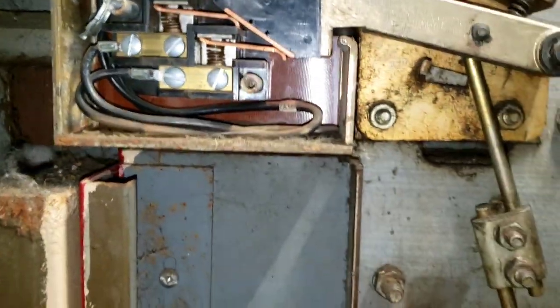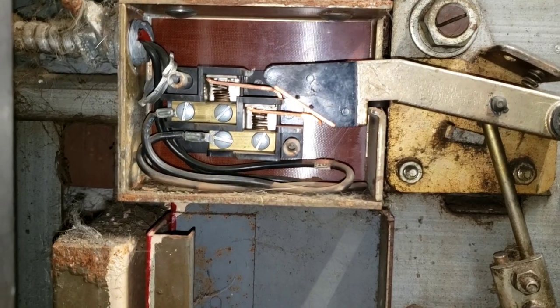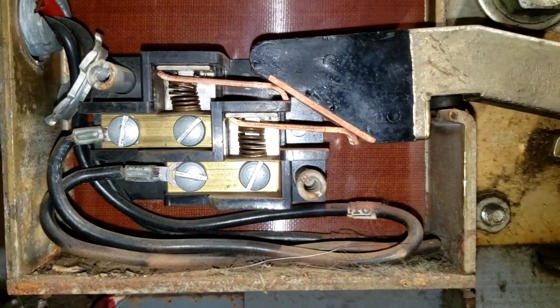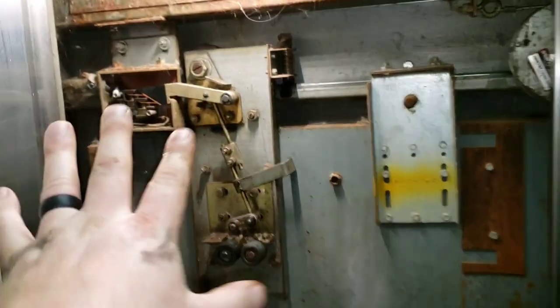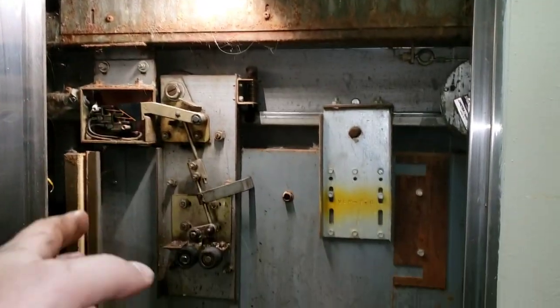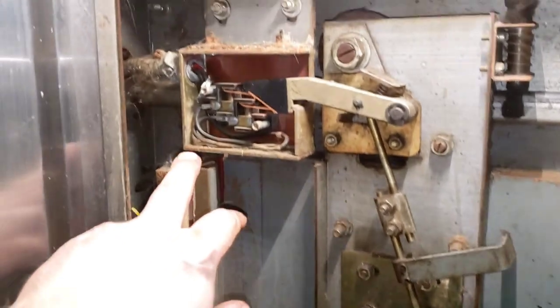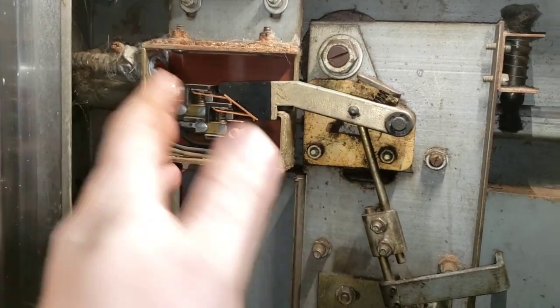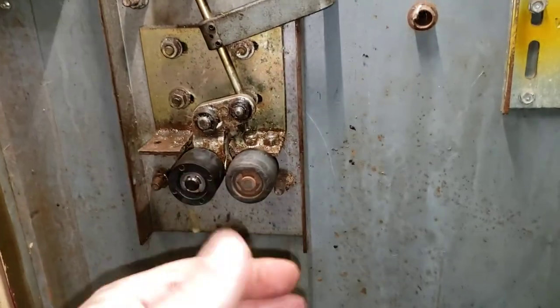You can see the contacts are arcing there. What you're looking for is when we pull this, it's not breaking again. This one is the basement, so you don't get as much attention to it — as you can see, I'm a little bit up from the bottom floor. You gotta get on the car top, open this, get down.